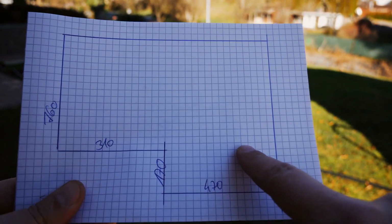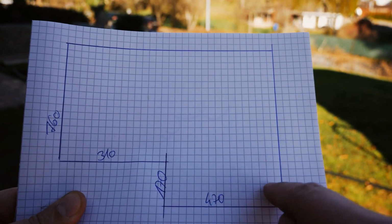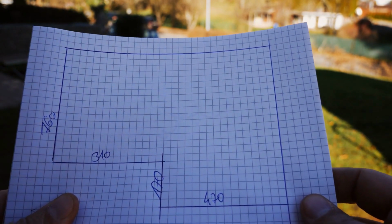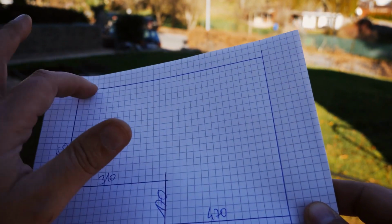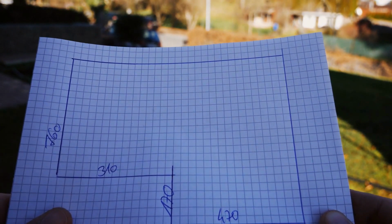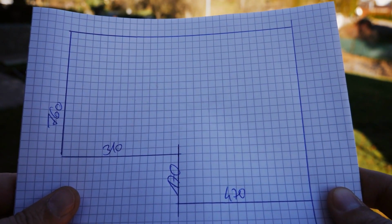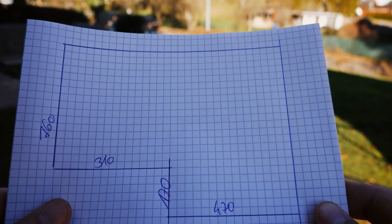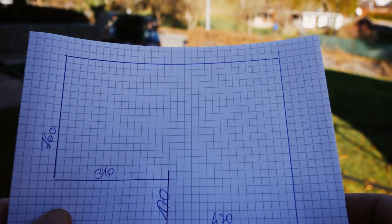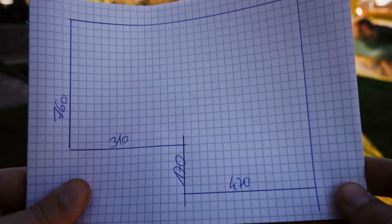However, I then have the problem down here somewhere that I would need to have one here that covers it in a semicircle. We have somewhere here in total approximately 1, 2, 3, 4, 5, 6 sprinklers that I couldn't run all at once, because for me the water pressure or the performance would no longer be sufficient. That means at this point we are already talking about at least 2 water circuits that must be placed here. I will just take this drawing now.